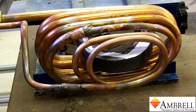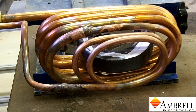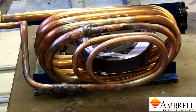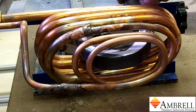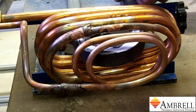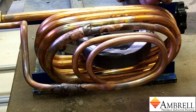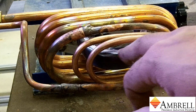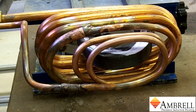As you can see, we have temperature indicating paint on this steel part. We are using an Ambrell EcoHeat 65 kW 100 kHz induction heating system for this application. We are using a multi-turn helical coil that has access from the back so the part can be easily inserted and removed.